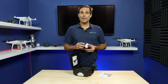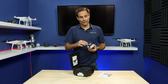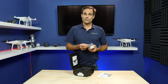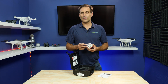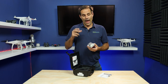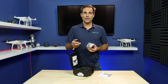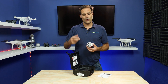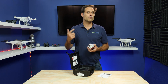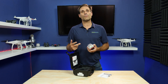Last year in November we came out with a new camera, a bit bigger than this one — it's called Altum. It has the same five sensors as this one, but with a bigger resolution. This one has eight centimeter resolution at 400 feet; the Altum has five centimeter resolution at 400 feet. The new camera also has a thermal channel, so besides the RGB image and the two infrared images, you can also have a thermal map of your field. It's the only camera that can make high-resolution multispectral and thermal mapping in one same flight and processing chain.